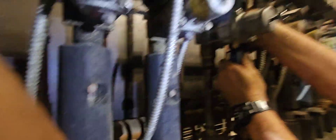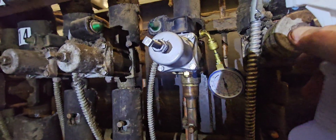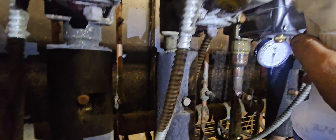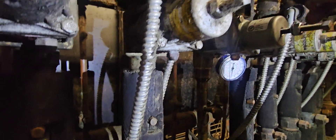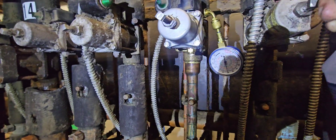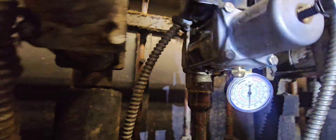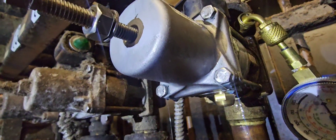We've got those strainers back in. Let's go ahead and turn this circuit back on. We've got it auto'd back in, so we'll let this thing run for about 10 minutes before we start adjusting the EPR. We're going to spray this thing with bubbles and do a quick leak check — make sure we're not leaking, make sure nothing's going on. We'll spray this whole valve since we had it all apart. Now we're just watching for any bubbles. Looking pretty good.